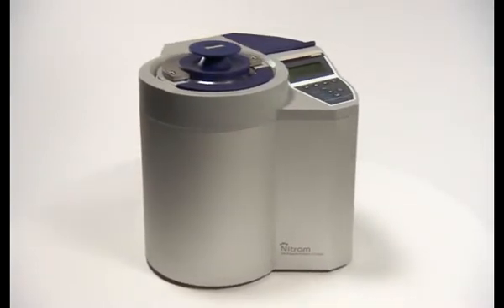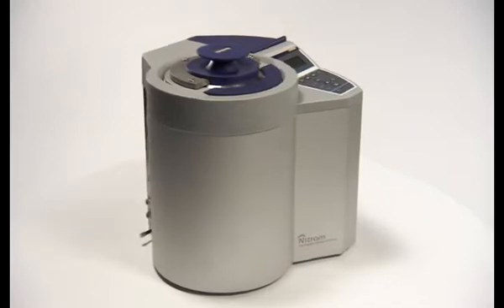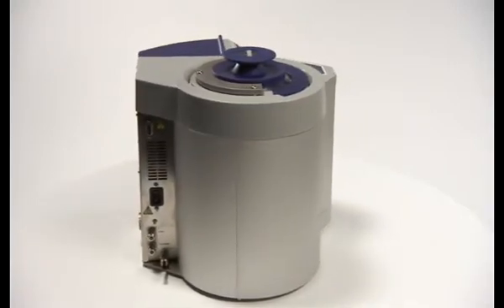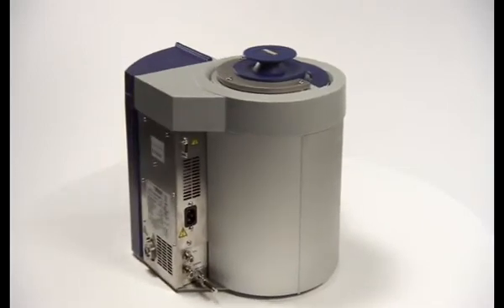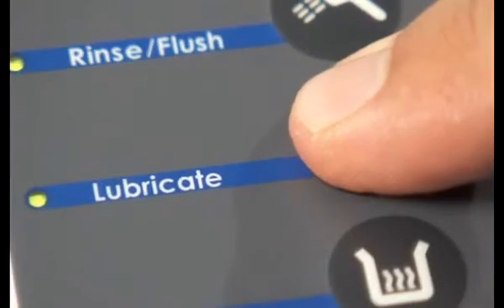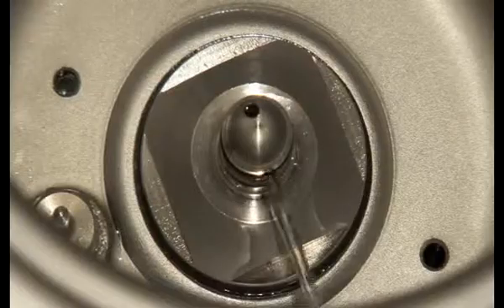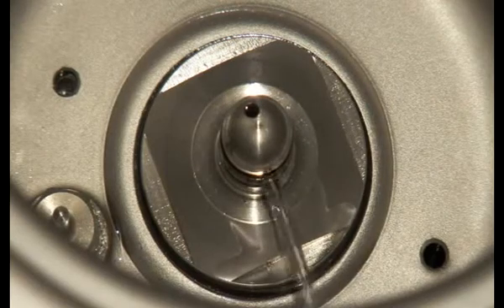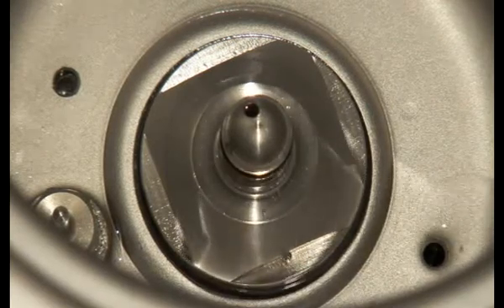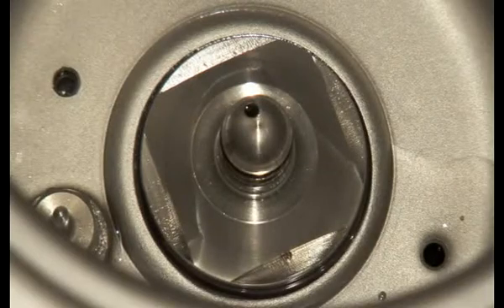Please find the serial number of your DAC Universal. The serial number can be found on the back plate of the autoclave. For DAC Universals with a serial number below 104,000, keep the lubricate button pressed. Within a few seconds, shots from the oil dispenser will be heard, and after a maximum of five to six shots, oil will enter the chamber from the bottom adapter. If no oil enters the chamber, please call your supplier.